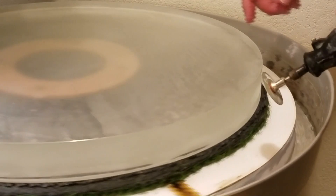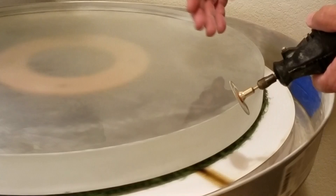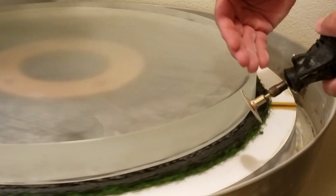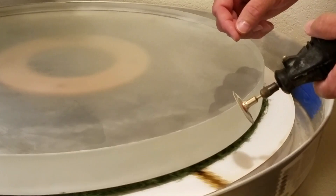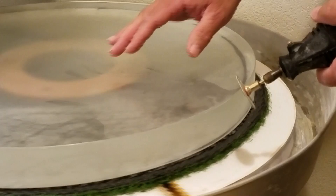I only went halfway around or so. For a normal bevel you do maybe anywhere from 3 to 20 laps depending on how much bevel is already there and how much you want. On the back you just do enough so it's not sharp anymore. On the front you want a more substantial bevel to avoid those chips. This is the first step prior to starting the real fabrication on this 20 inch f3.3 mirror blank.